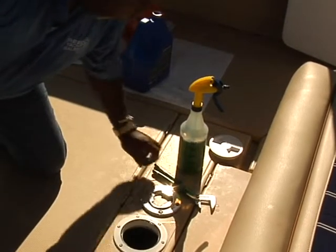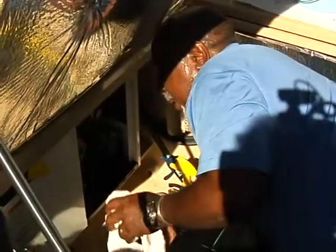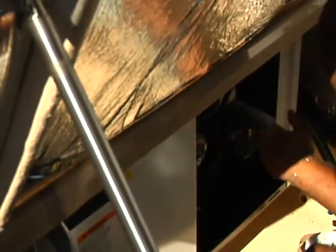I'm going to lift the lid again and take a look at the generator as we start it back up. I realized I had gone a little bit too fast on at least one of the pours and had a little oil drooling down — just clean that up. At this point we're ready to fire the generator and we're going to be looking for leaks.